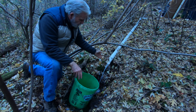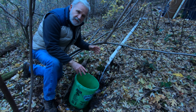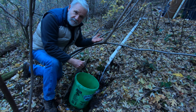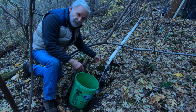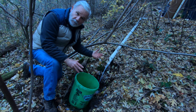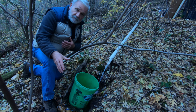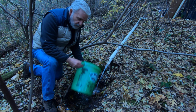We're down here at the discharge pipe which comes down from our water tank, and you can see some water is flowing out right now. That's the water the tank doesn't need. We keep this running because when we flush a toilet or take a shower, we need to fill the tank back up again. What we want to see is if we open the valve up further, how much more water can we collect? That would be the water we can use for a micro hydro system. So Karen's going to turn the water on now, and we'll see how much we can collect on a gallons-per-minute basis using this five-gallon bucket.